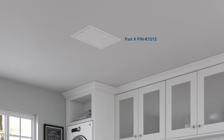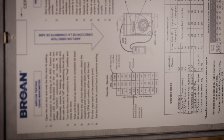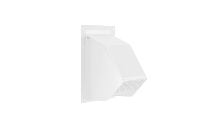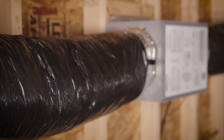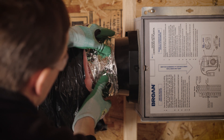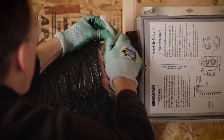We offer an optional finishing trim ring for a finished seamless look. Close the unit lid. It's now time to install the flexible 6 inch round insulated duct with no less than an R4 insulation factor. The air intake hood should be at least 12 inches off the ground and 6 feet from any exhausts or other sources of air contamination. The straightest, shortest duct routing is preferred for optimum performance. Slide the inner 6 inch round flexible duct over the port and secure using a tie wrap.